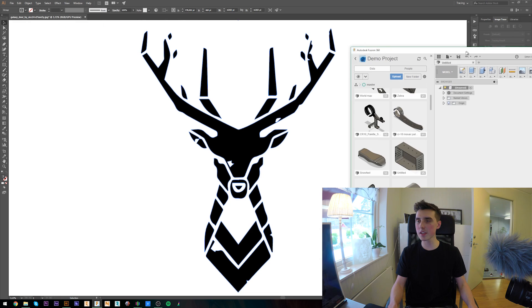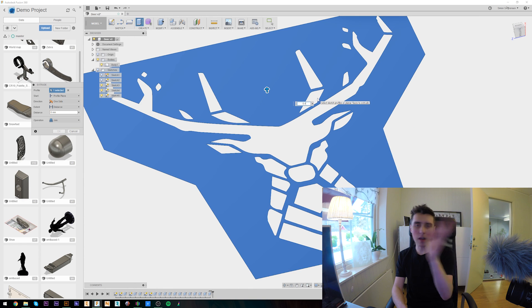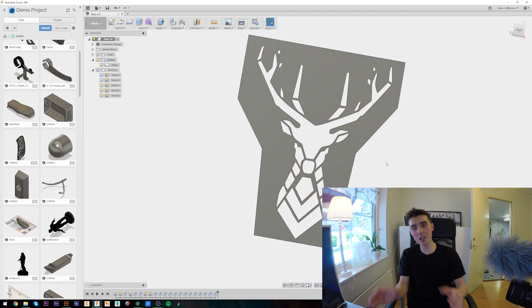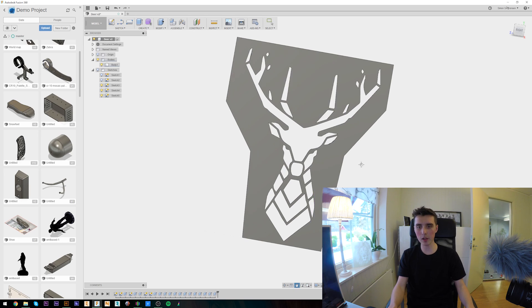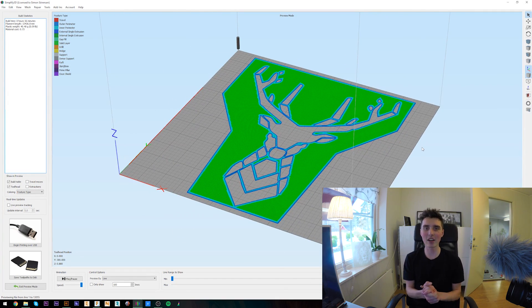Next up is Fusion 360. Insert the SVG, click the plane, click your Rudolph 2.0. It doesn't have to be thicker than 0.4 millimeters — that's two layers. If you have really good bed leveling you could probably get away with just one layer. Cutting off the edges like that saves a lot of time as well. I might even have to use the CR-10 500 for this, but right now I'm rocking the Creality CR-10 edge to edge on the build plate. Let's hope for the best and start printing.